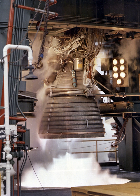While work on the J-2S continued, NASA also funded a design effort using J-2S turbo machinery and plumbing connected to a toroidal combustion chamber with a new aerospike nozzle, which would improve performance even further. Two versions were built: the J-2T-200K providing 890 kN thrust, compatible with existing S-2 and S-IVB stages, and the J-2T-250K of 1,100 kN. Like the J-2S, work on the J-2T progressed to a lengthy series of ground-based test runs, but further development ended in the post-Apollo drawdown.